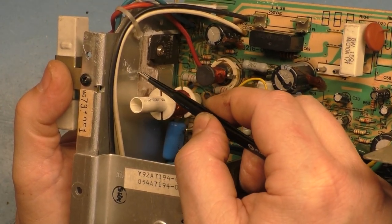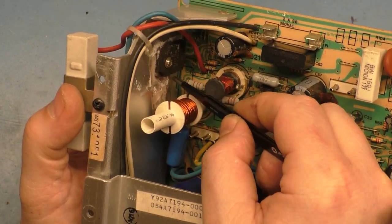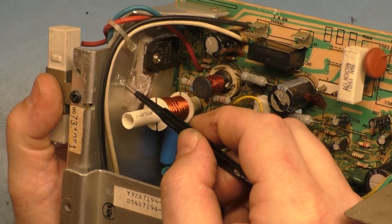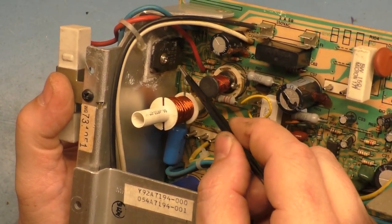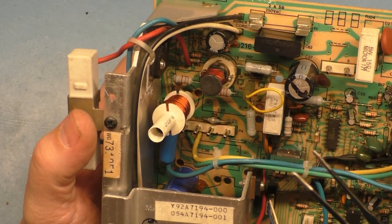This is the insulator for the wide, the fat one. And someone has installed a tall, skinny regulator, and they didn't change out the insulator to the correct one. This is for the fat wide one, so I don't even know why they would do that. It would work just fine the way that it is, but the voltage regulator is also loose on there. That's another problem. Fuse is missing.